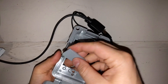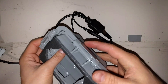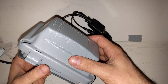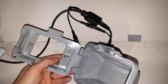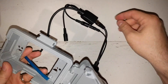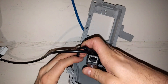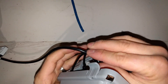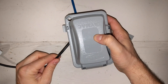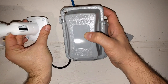You can put the cables through either side here — fish it through the bottom or the side. It has a pin that you can remove and reposition so the box can open the other way. The idea is I'm going to fish an Ethernet cable — this is a CAT-6 cable — through my exterior wall and have it come right into this box. Then I'll connect that to all of this cabling, stuff it inside the box, and have the cable come out the side so I can close the box and have a nice weatherproof enclosure. I'll mount this to the side of the wall, make a little drip loop with the camera wire, and mount them side by side.